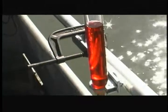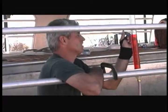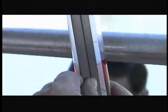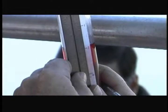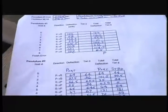A U-tube is another device that can be used to calculate the GM of a vessel. The U-tube is a slightly different sort of pendulum — the water level will shift as the boat tips one way or the other as it heels. Measurements are taken on both the port and starboard tubes to determine the distance of each movement. The same formula is then applied to calculate the GM.